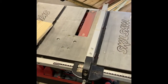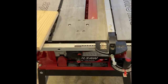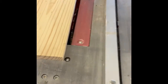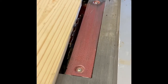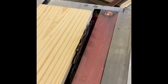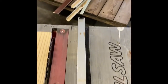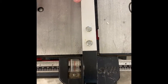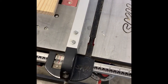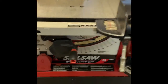The next tool I'm going to be using is a power tool — it's a table saw. It's a very basic table saw. The table saw will cut many different sizes of material. First thing we're going to do is adjust our blade height so it goes above the piece we're cutting. My slide bar I can adjust to whatever thickness or width I want it cut. Once you get it where you need it, you lock it down. This particular table saw is pretty handy but it's just a home use one.